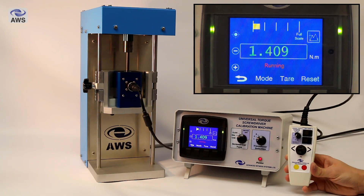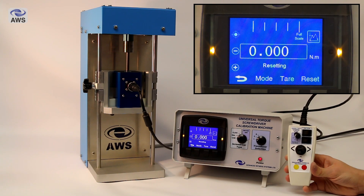The first peak is not transmitted on RS-232 during the learning phase. The machine will stop once it has returned to zero and will display ready to operate. You can then select the number of operations using the dial on the handheld controller and press and hold the yellow button for half a second and release to run the machine. The machine will run and automatically complete the selected number of operations, and each time the captured first peaks are transmitted on RS-232 to the Kepler-4 software. Once again the machine will stop once it has completed the selected number of operations and will display ready to operate, awaiting the operator's next instructions.